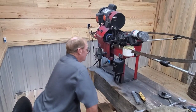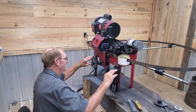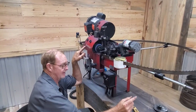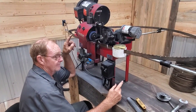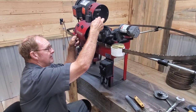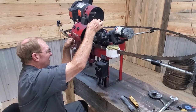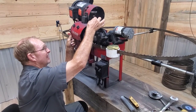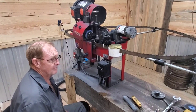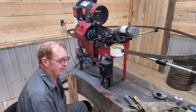Whenever you go from one cam to another, if you're not careful you'll cut the blade in two when that stone comes down. Always set it higher and work it down into the actual teeth — always go higher first. Just like on the setter, starting at zero first. Another thing about this: Thomas has a Timber King setter and sharpener and whenever you turn it on it goes full speed immediately with no speed adjustment. But this Cook's machine — he can make it crawl or run wide open.